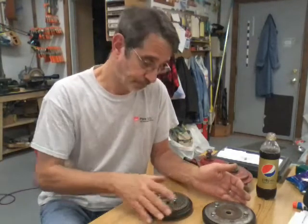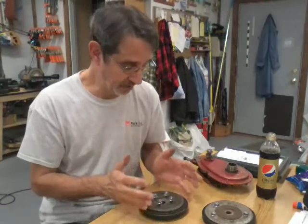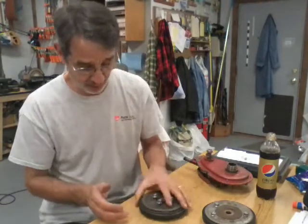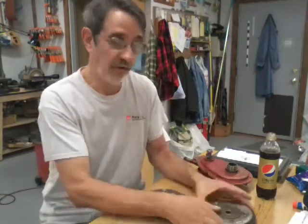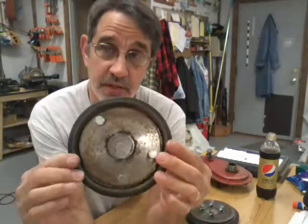The clutch on the old machines was not this type. These are called a soft-start clutch — that's the biggest issue everybody has with their Snappers. When they won't go or they slip, they won't go up a hill, it's because of this. You have to tighten up your yoke spring to get away from the slippage. The clutches on the old machines were a solid steel disc.